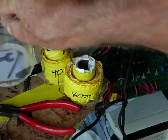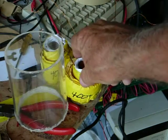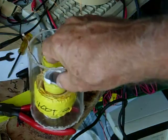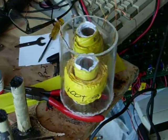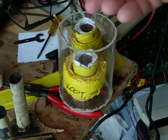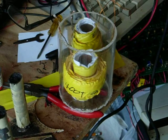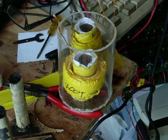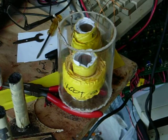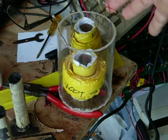These are going to be supported and placed in these plexiglass tubes here, and then some mineral oil will be placed inside with the high voltage connection, ground, and the secondary. I'm going to use Gerard's cold electricity output from his washing machine motor to drive the 120-volt input to a neon transformer — a 9,000-volt, 30-milliamp neon transformer — to drive the high voltage section.